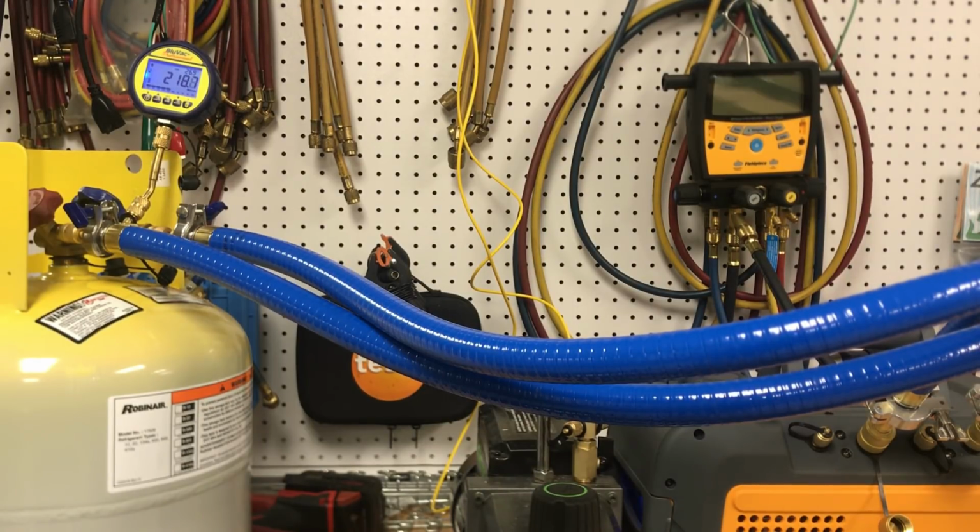So, fairly impressive setup. We'll just see what it'll go to in 10 minutes. I don't have any reason to just let it run and see what it'll actually go to. I know some guys might wonder about that, but when you're under 500 microns, you're seriously achieving your job. We're at 7 minutes and 15 seconds and closely approaching 200 microns. So it's working pretty well.